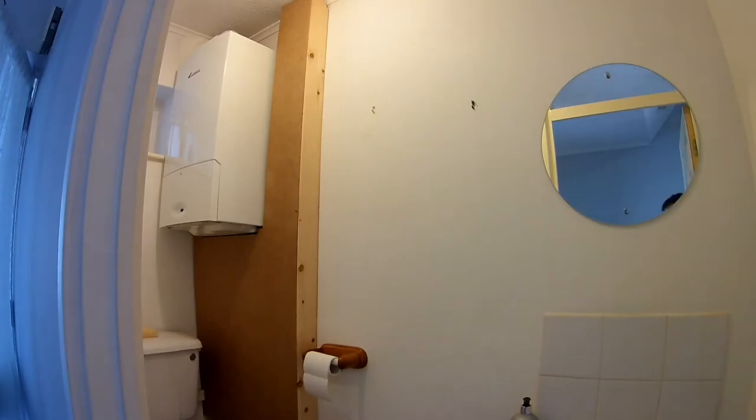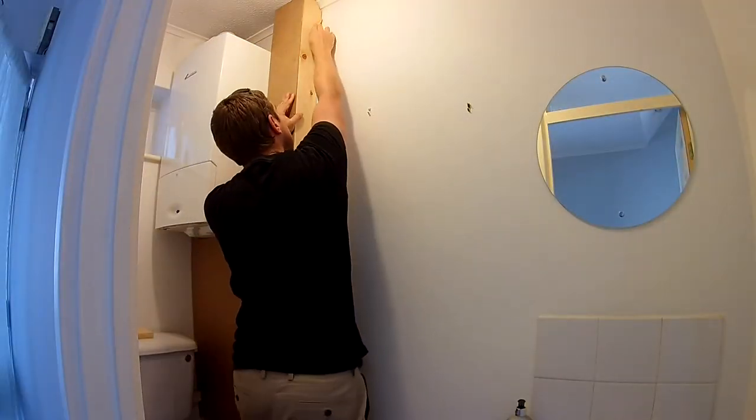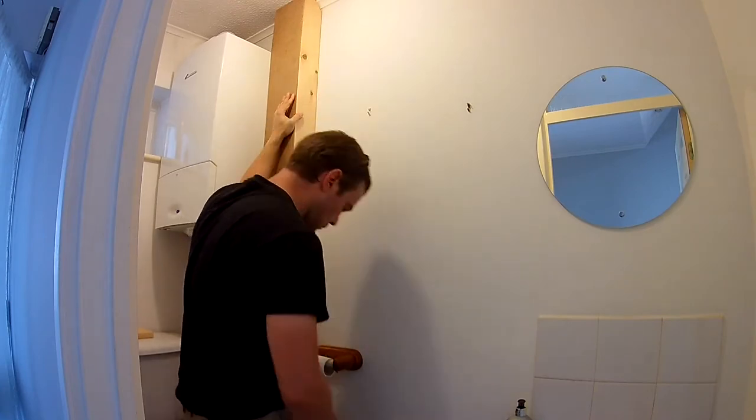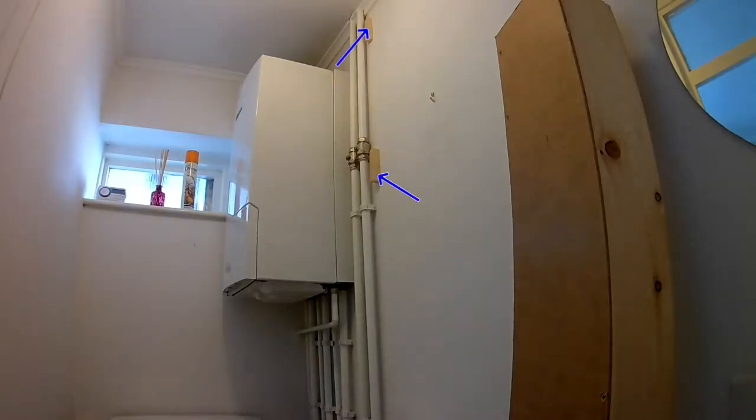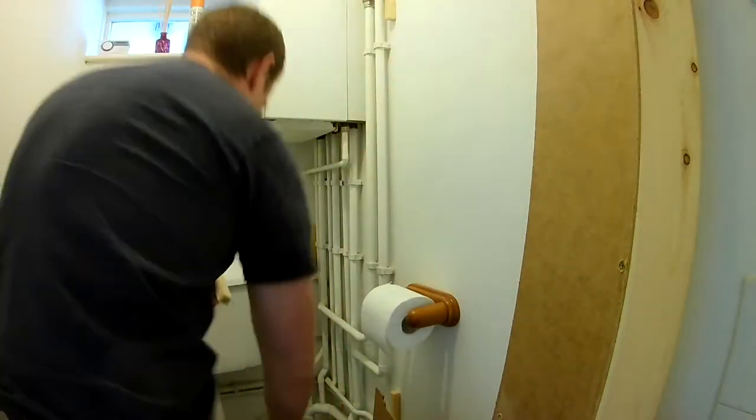So at this point the box is pretty much holding itself in place. It does still need to be anchored properly, so that brings me on to fitting some wall supports. These supports are 2x2 offcuts of the 10cm plank, which is big enough to run a couple of screws through into the wall, and then run a screw through the side of the box into the support.